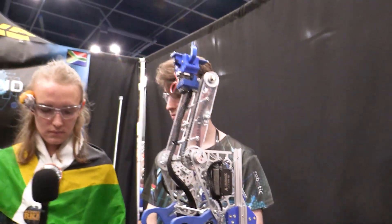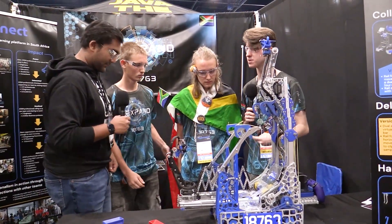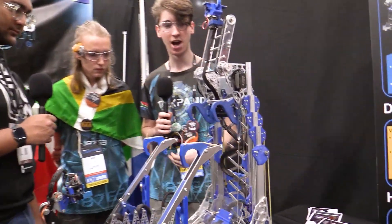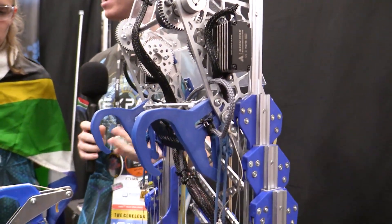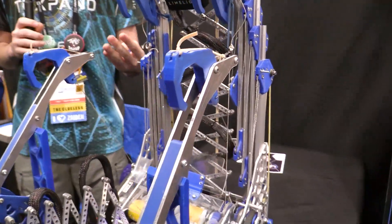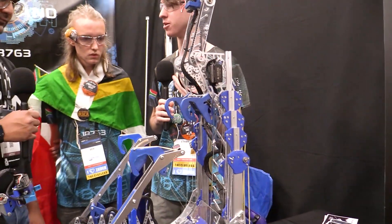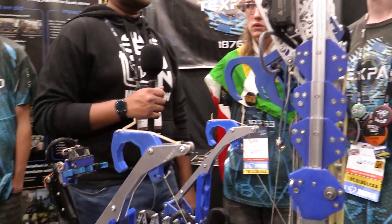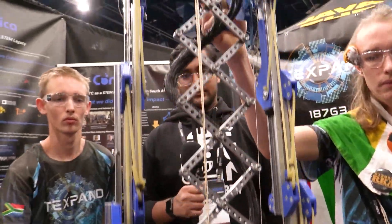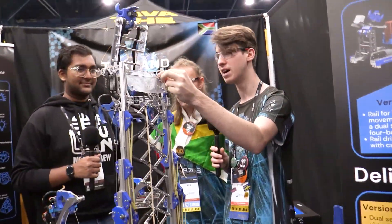Let's jump into that lift - year after year your lifts are fantastic. What has made this one so fast? We've been refining speed over the whole season. In our first version we ran on one motor because this is our first season using these slides - we thought the weight would allow one motor, but quickly found it wasn't powerful enough. In our second design we added two motors both running at 1150 RPM, one-to-one on 27mm spools. We also added counter springs - surgical tubing in a cascade configuration - which helps a lot for our first stage and keeps our camera scan position really precise.